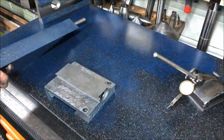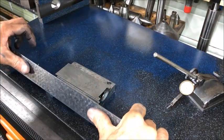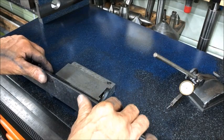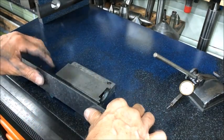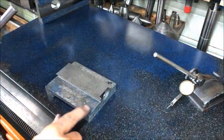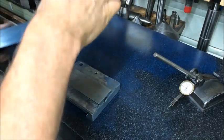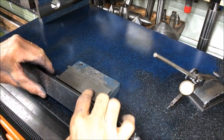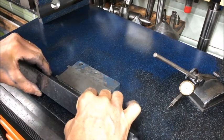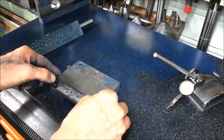Whatever scraping method, at least verify that it is not high in the middle. I now relieved it a little bit in the middle actually. And then it feels better now — it hinges now over here but mostly there, so I may have relieved it a little bit too much. It moves up over here, a little bit here. I just lift it and try to feel, and now it's also more even here. I'm actually forcing it to hit on the outer edges more than in the middle.